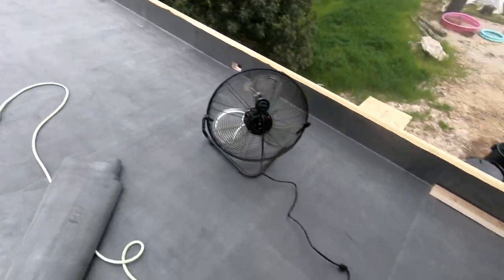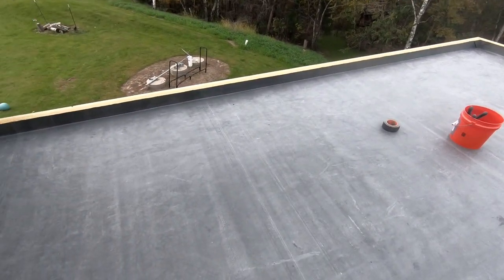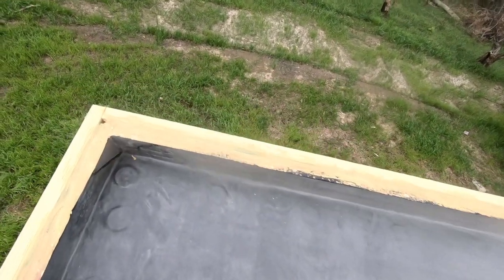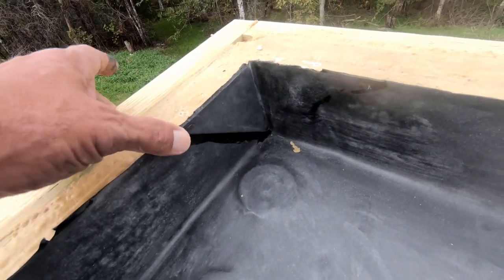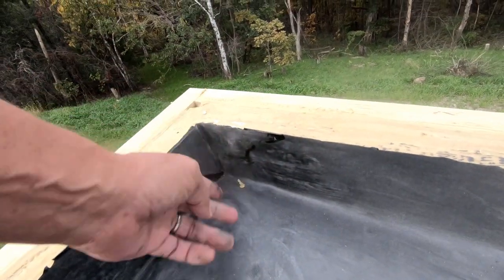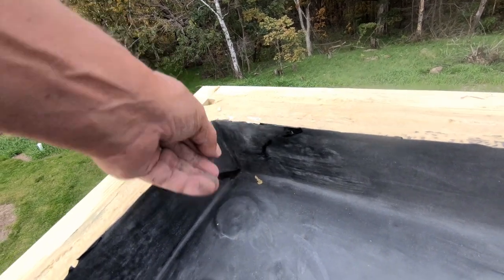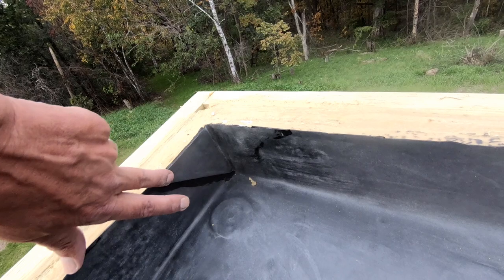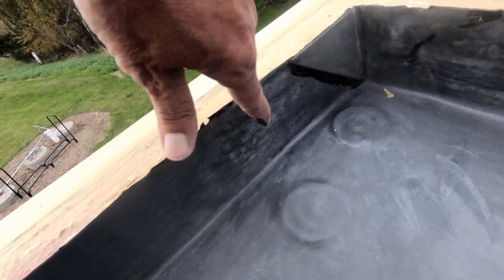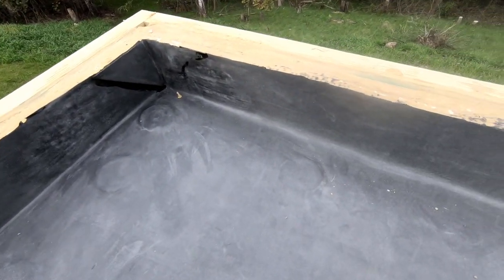I'd rather it didn't rain, so I'm going to try to get those in before the rain tomorrow. Everything else should be just fine. This is a normal corner. They're hard to keep the very end closed, but you run this into the corner as tight as you can and then you seal the leftover together. You've got to put contact adhesive on everything, and then you stick that triangle over to the side. When it has the termination bar going across it, there's no way that's going to leak. This is kind of like a tub now.